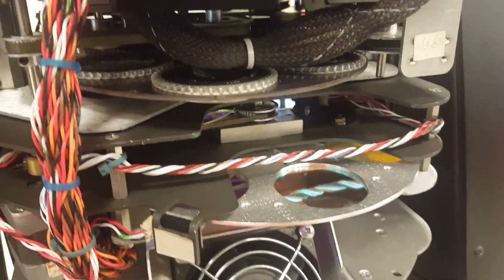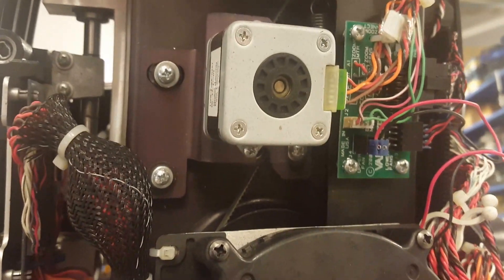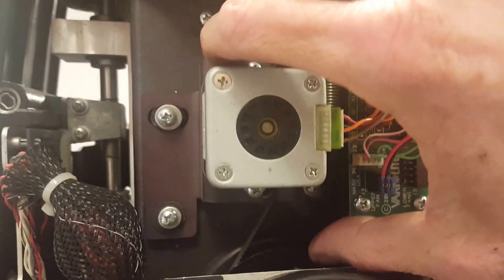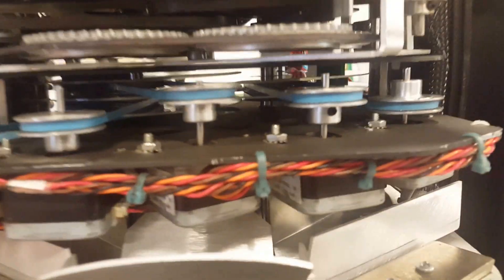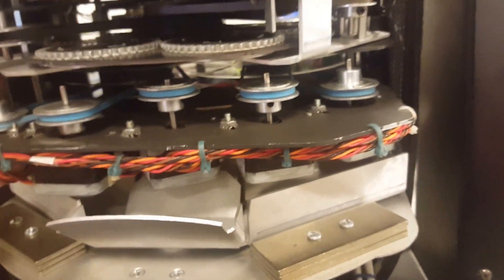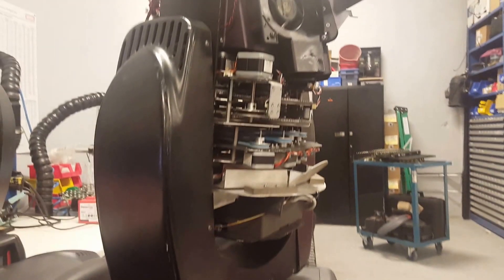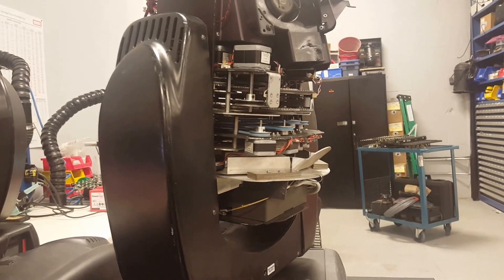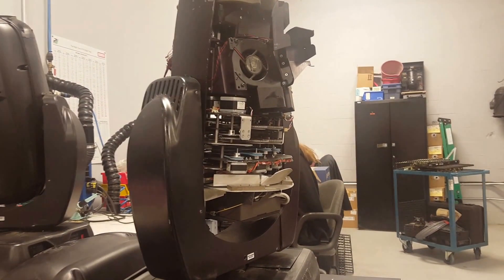There are other belts — you have one for the zoom inside. We rarely adjust that one, but if you need to, you just loosen the screws on both sides and the spring will put the correct tension on it. I did a video earlier with the VL that had a tilt drag problem — that one showed how to properly adjust the tilt belt tension. I'll do another one for the pan belt underneath. Hope you enjoyed the video — this is how to adjust the belt tensions in a VL3000 spot. Share, like, subscribe to my YouTube channel and Facebook page — thanks!